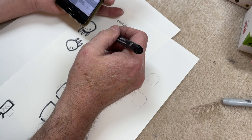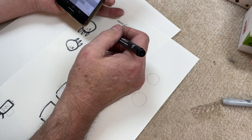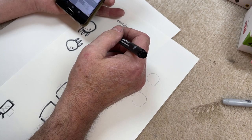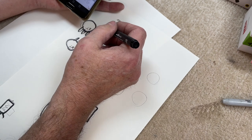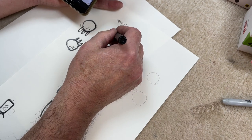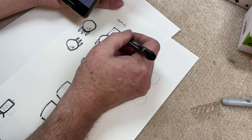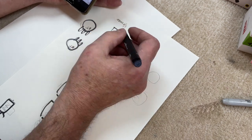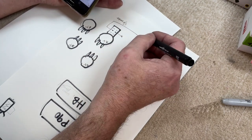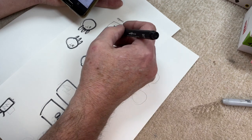So in this diagram, this is a Seymour Duncan. I had to translate this across last time, which completely messed me up. But it looks to be the same. Seymour Duncan is red and white there. We've got green is the positive, we believe, and black is the negative. No, black is the positive, green is the negative. That's it. So green is negative. Right, we'll trust that to be the case. So red and white. So this one here is red. This one here is, where's my humbucker? Oh, there it is, white. This one here is white, and that goes across to there.